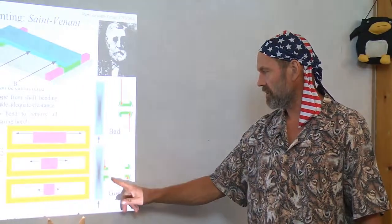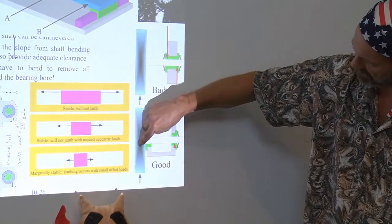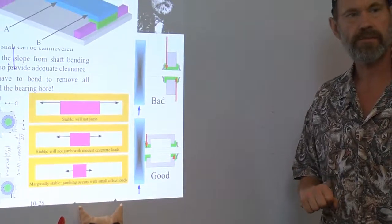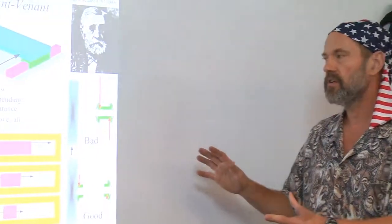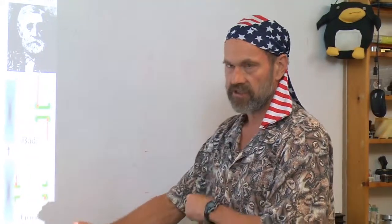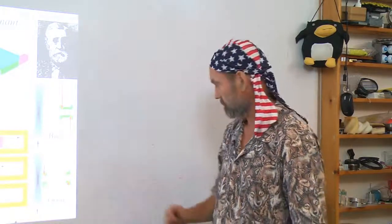Spacing of the bearings, here we are about 4 shaft diameters apart, and the loads are being applied only 1 to 2 shaft diameters from the first bearing. This is a very good design. It's amazing how much good design you can do just by looking and applying fundamental principles. It allows you to lay out the machine such that when you then do go to do the analysis to predict the deformation and loads, you are very close, needing just a little bit of tweaking to get it where you need it to be without having to fundamentally redesign things.